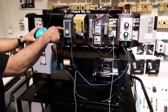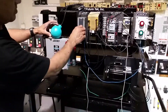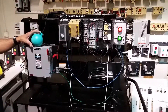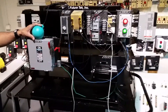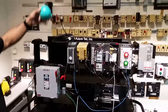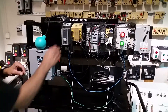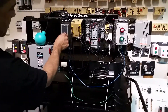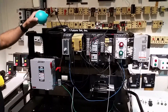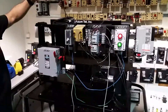It's like the main power source is off. Turn the switch to the left — it is now in the manual position. It's going to work manually; the ball will have no effect on the motor. Flip back to auto position, raise the ball one more time, and the motor kicks back on again.